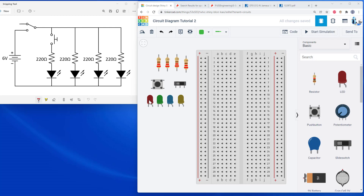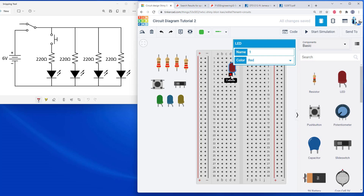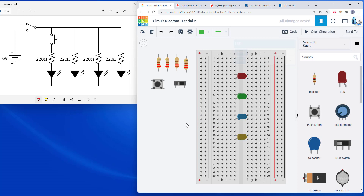I'm going to put an LED every five rows to give myself plenty of space. Remember, you cannot put an LED with both legs in the same row of a breadboard because those will be shorted together — that's covered in the first video. I'm going to rotate my LEDs so they're in two adjacent rows. I'll start in row five, then row 10, row 15, and row 20. I'm choosing LEDs to start my circuit around, but I could have started with resistors instead.